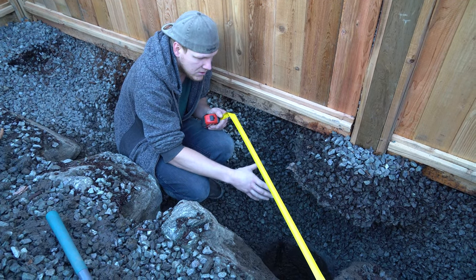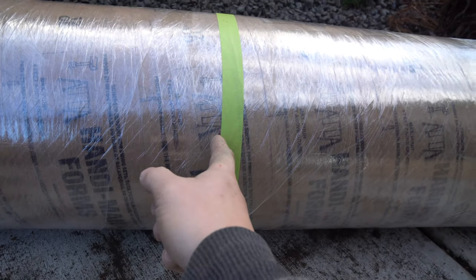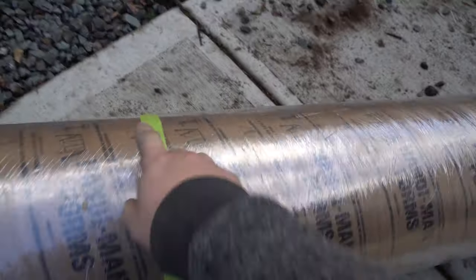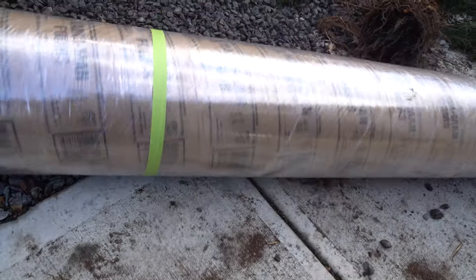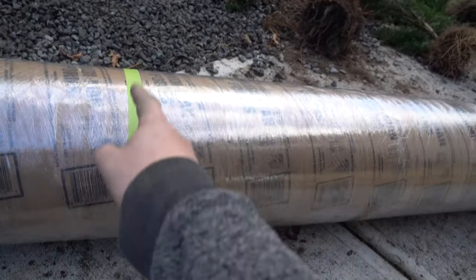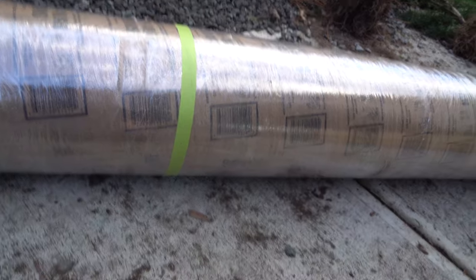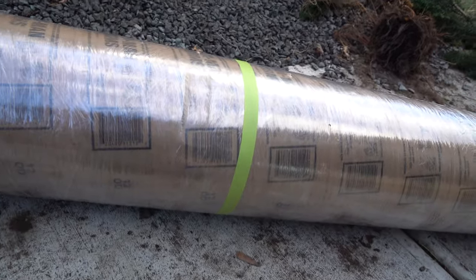Now it's time to slide this tube in. I'll unwrap it before I slide it in — I just didn't want it to get too marked up. A lot of people are asking why I'm doing it this way. One, it can help the post not rot, and two, look at all the moisture in there. That's the last thing I want eating my post away, especially since it's going into the clay. At least this way it'll make a nice strong brace. I've got some saddles to slip in, but right now I'll put the first one into this hole.